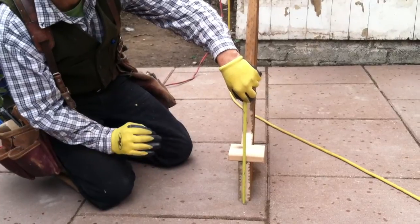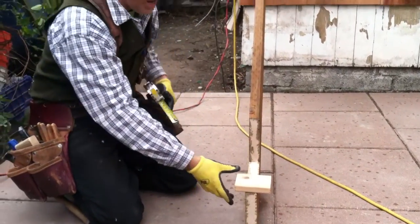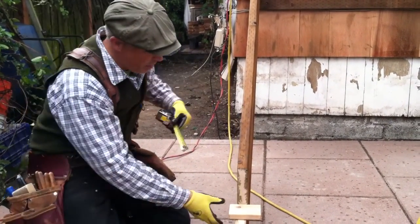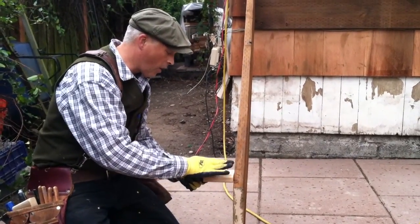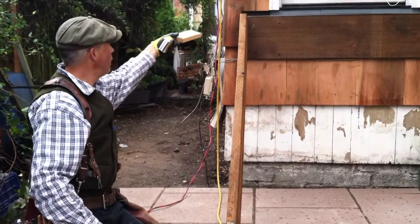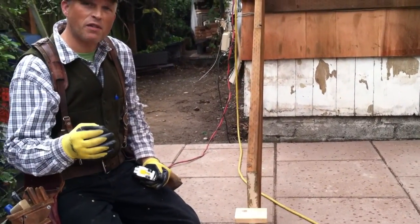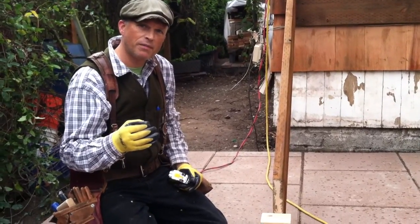If we put our treads on, when we're doing our finishes like this, we have 6 and 13/16. Does it make sense why it's really important to cut your stringers off? As you go up, now you've got 5 and 13/16, but you're adding a half or a full inch material all the way up. So when you're finished, everything will be to the finished riser calculation, which is 6 and 13/16 plus.